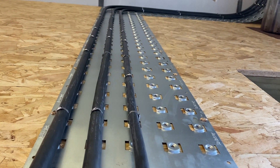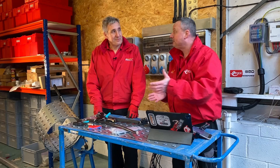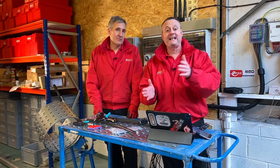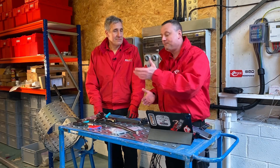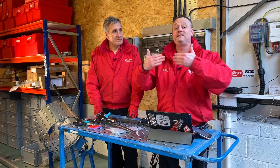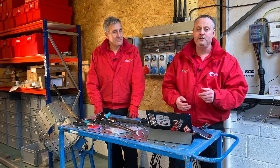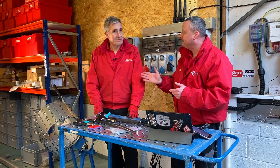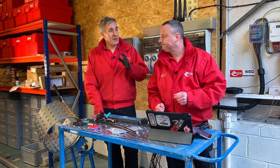People here couldn't get their heads around the fact that we'd use a steel tie on an electric cable. So why would we do that? We're thinking about premature collapsing of surface wiring systems - this is for the UK. Throughout the run of a cable system that in the event of a fire would melt plastic cable ties traditionally holding armored cables in place, that system would fall down. To prevent that, you can have steel fixings, and that's what we had.